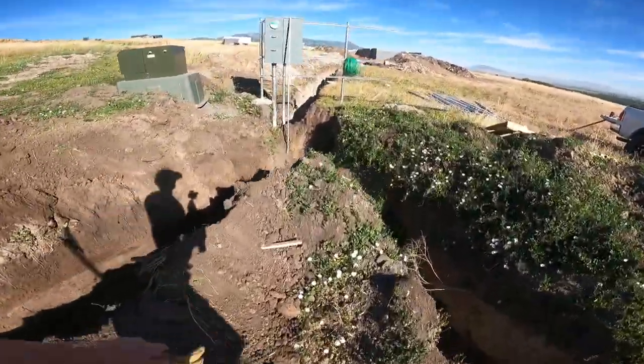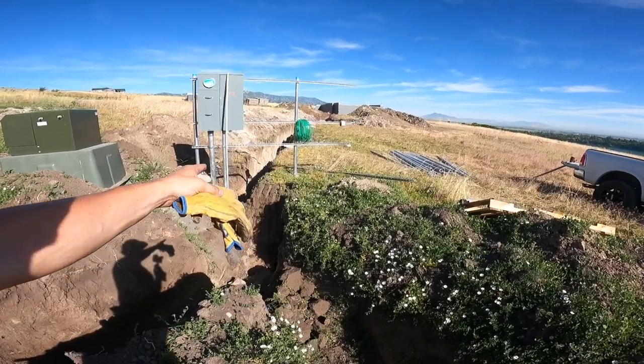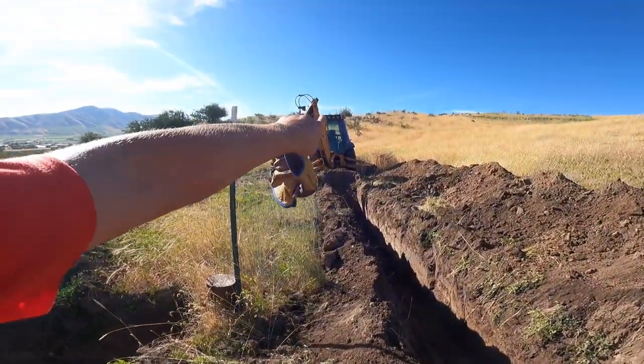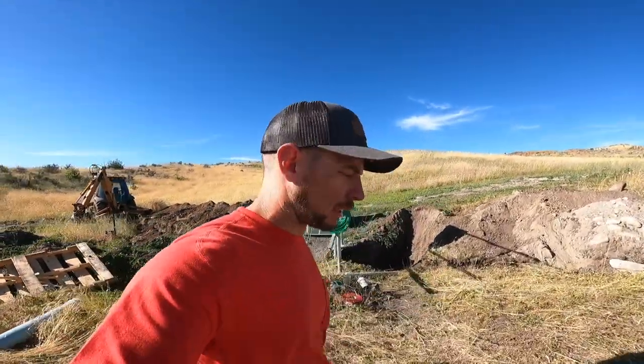We are getting work done — the trench is all the way finished, all the wire is back out and spooled up. I'm ready to start putting pipe together. The propane tanks will sit out here, electrical will sit there. There are guidelines for all of that — look up the minimums in your area. Typically gas and electric have to be 24 inches apart, water and electric have to be 12 inches apart, and water and gas also about 12 inches apart, so that a malfunction won't cause cascading problems.